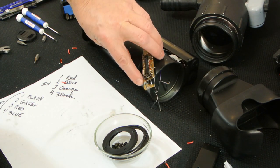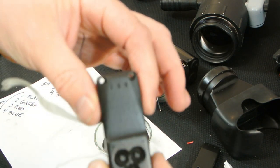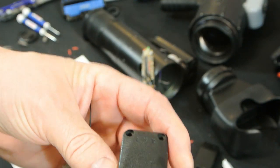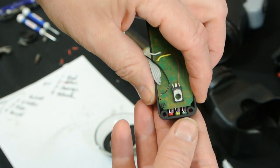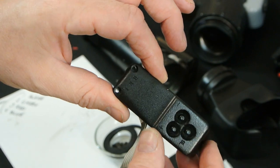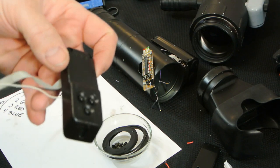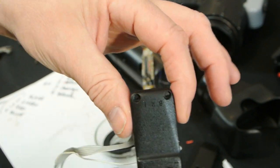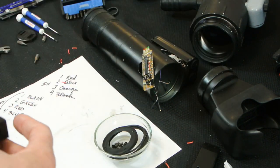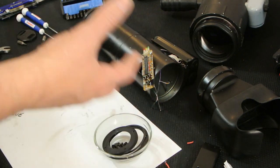There is one little pot on here and I did try tweaking on that — that didn't get me any performance gain. Now I'm going to show you something — this other one looks kind of similar: SL plus minus, green, yellow, red LEDs. This came off of an old Gen 1 ATN scope — I think it was a Mark 258 or something. The tube was pretty much shot when I got it. Same functionality, everything. That tells me this is all ATN. So it's an ATN marketed by Tasco — Gen 2 MX-9644.